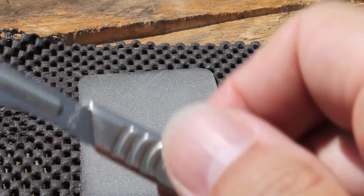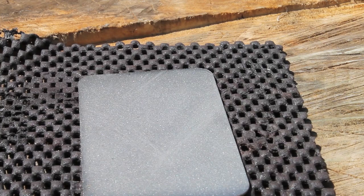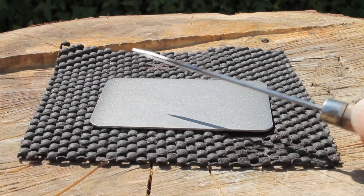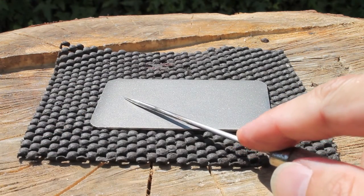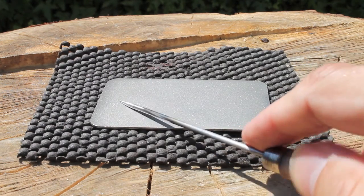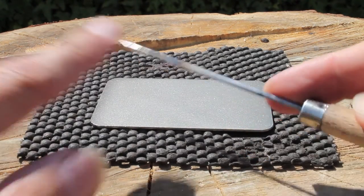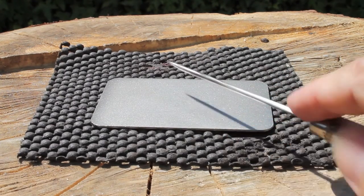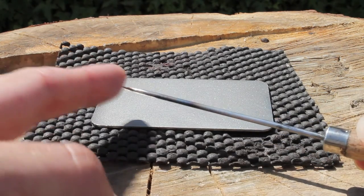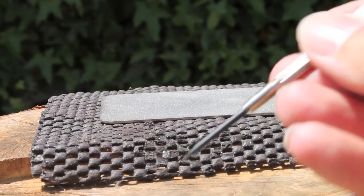When you've finished, use a little piece of leather or something just to wipe the blade and take any burrs off, and you should find it's nice and sharp. For solder picks and scribes — I absolutely love my solder pick and I like it nice and sharp. Place it on the sharpening stone at a very shallow angle, make sure the very tip is level with the surface, and as you move it horizontally just rotate it. Keep it rotating at all times as you move. This will remove solder flux and any contaminant, and keep your tip nice, sharp, rounded, and pointed.